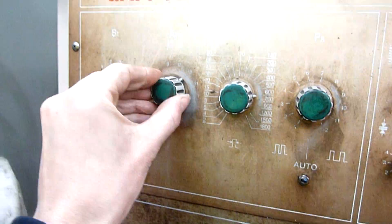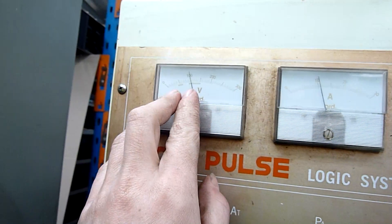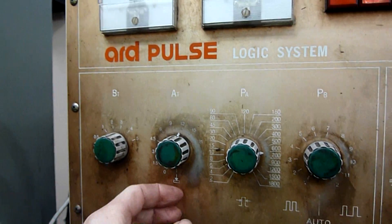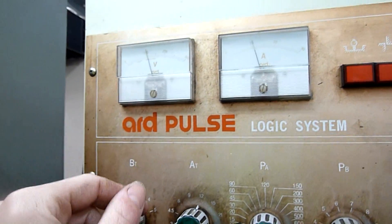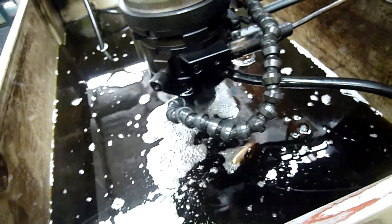I'm really pumping the amps into it — I don't do that for too long. About 10, 11 amps, 105 volts-ish — somewhere around 105 volts DC. It's positive to the electrode, negative to the table by the looks of it. But you can reverse that so you can EDM aluminium and other metals like that. You can actually EDM copper using a stainless electrode — that's a good one.